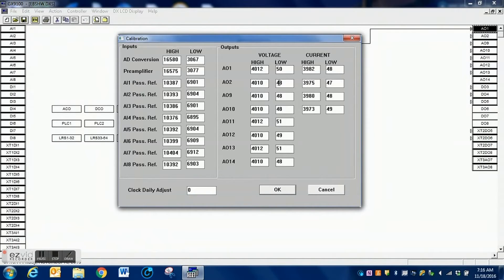Once again, if you change the values from what are on the DX itself, your inputs and outputs will change in how they function. If you flip these values — the high and the low — your inputs and outputs can actually work backwards. That is something to take note of, and in some cases may be necessary depending on the application.